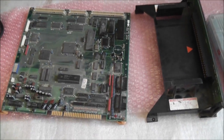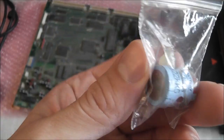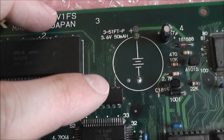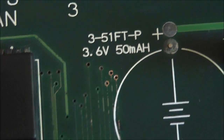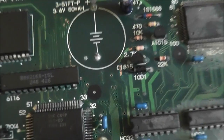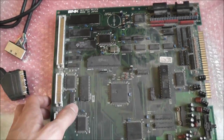I've already taken the board partially apart but haven't really done much work on it yet. I did snip off the dodgy battery that was on there — that's the one that leaked everywhere and caused the damage. There's some damage around the battery area and I found one broken trace right there. I scraped off some of the covering to check with the multimeter, working away from the battery outwards across all the areas that looked damaged by the leak, and I've only found one dodgy trace so far, which isn't too bad.